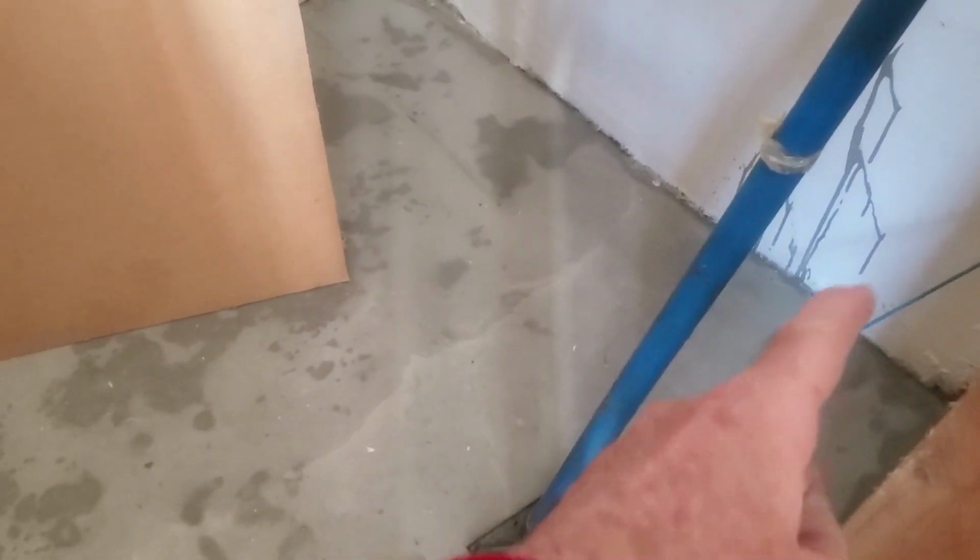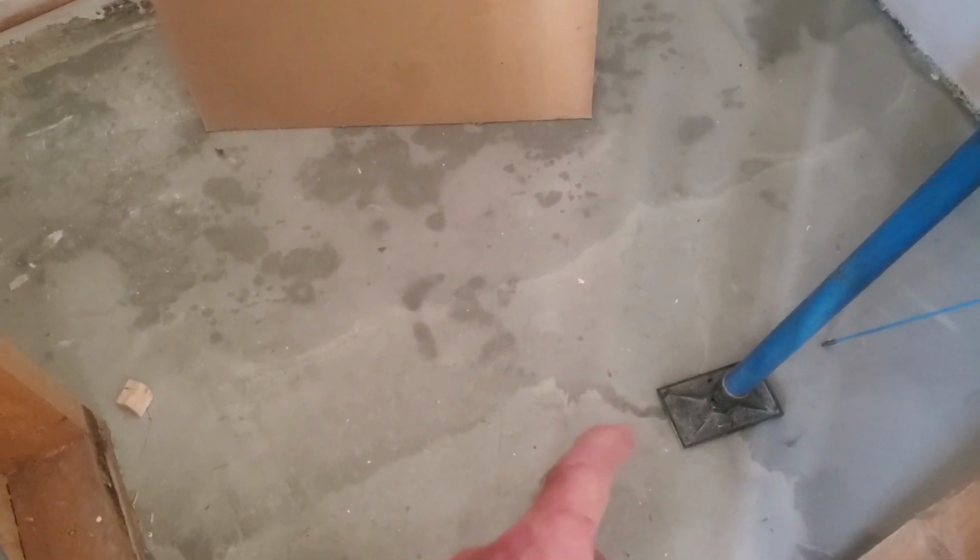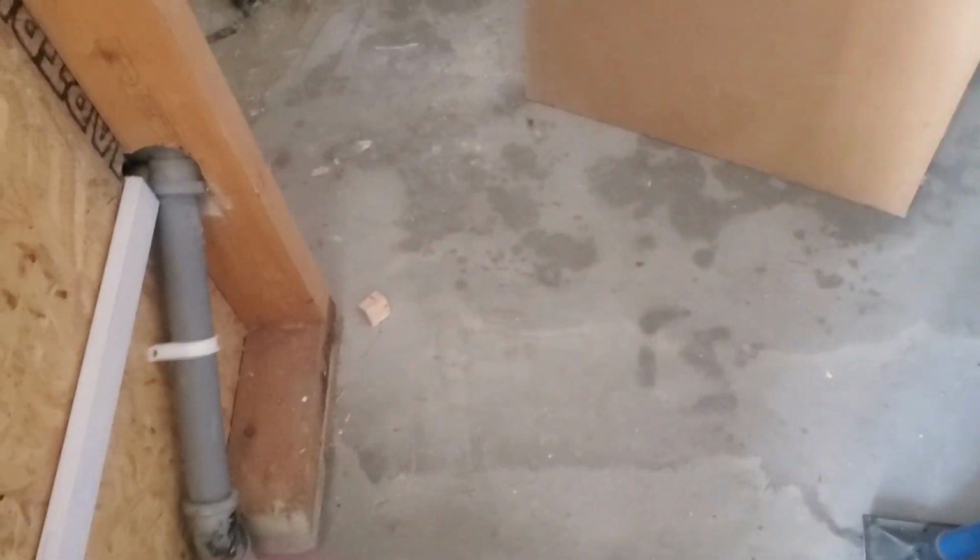There's quick drying cement, a postcrete to fill up the big holes I dug out, and then there's self-leveling floor compound that goes to a pretty deep depth. So this stuff I've got now can go, I can't mind now, to do that floor anyway. So we'll get that floor completely leveled off and one more coat. Yeah, I couldn't fill it up in one go. There's nothing that would fill up the full depth.